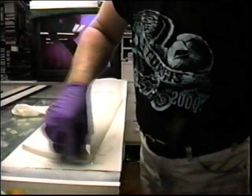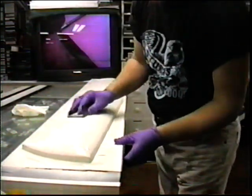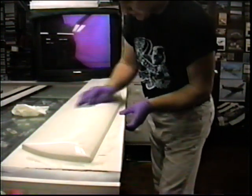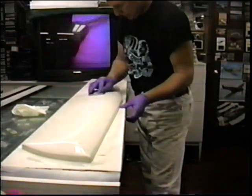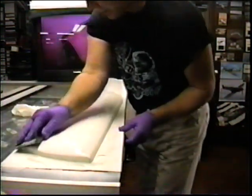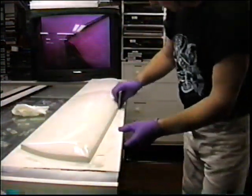What I've tried to do is almost everything with a block if possible. And I don't want to go in one direction. I want to constantly change the direction so I can pick up any other imperfections in here. They can sand one wing while that other one is kind of drying out. I want to get a nice radius on the trailing edge if possible, because we'll have the material here this week to build a mold.